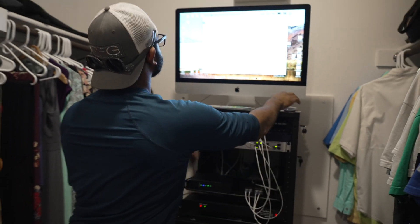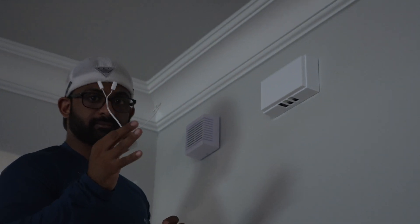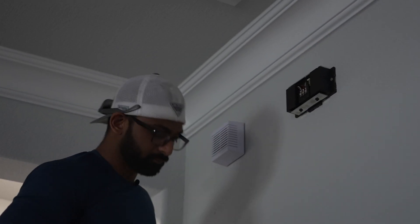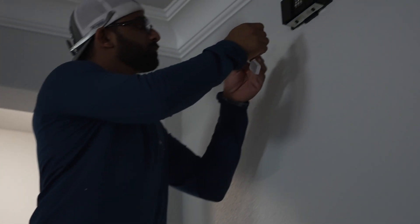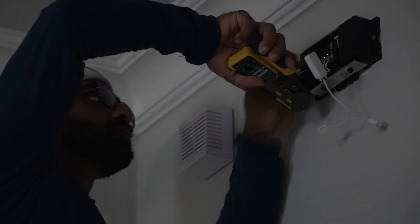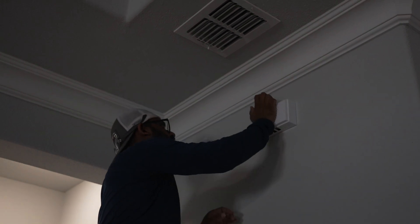We can initialize the drive here. Pretty much the last step of installing the G4 doorbell by Ubiquiti is to add these little diodes — or voltage droppers, whatever you want to call them. Basically we think there's too much voltage going to the doorbell causing a little bit of a hum. That takes care of it — thanks Brandon!